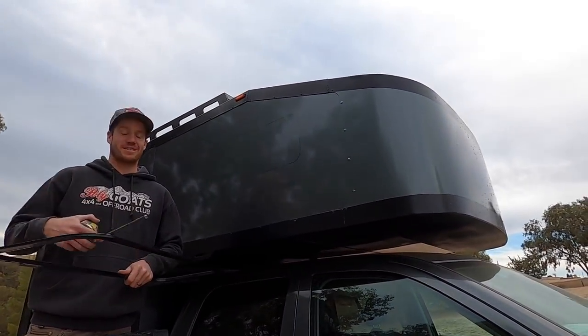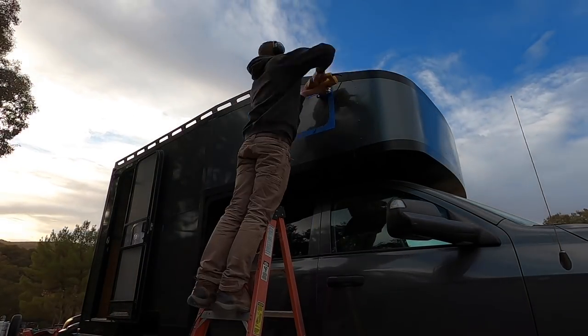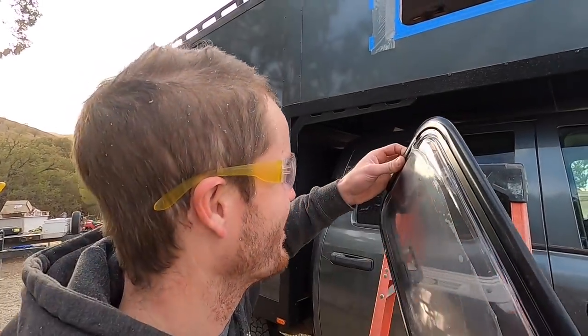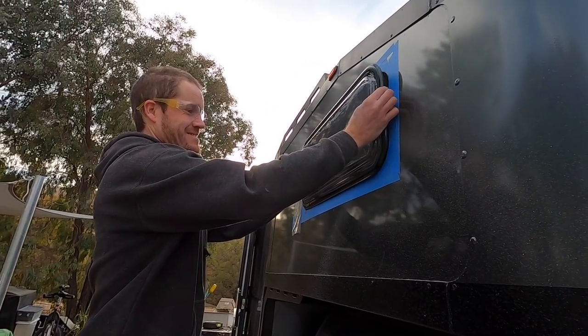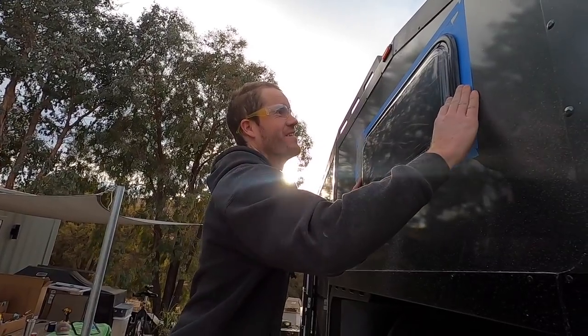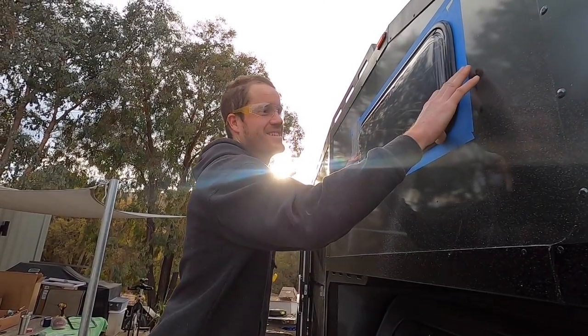When I close one eye, I can see the tape move. They also give you the cutout dimensions in millimeters, but my micrometer does not work in millimeters. We're about to find out if the window fits in the hole we cut. Does it fit? I hope so. Yeah, it fits — we got maybe a sixteenth of an inch up and down wiggle and almost nothing left and right, but it fits. Perfect.